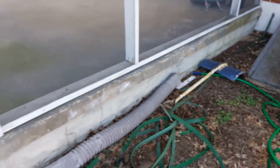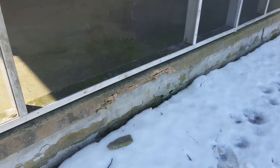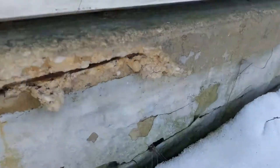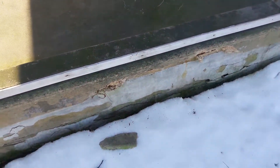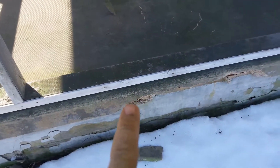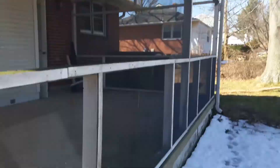The porch is in good shape otherwise — it just takes a little repairing. You're going to cut that out, get rid of the rusted metal, and put some rust neutralizer on any remaining ends after you cut it out. Then you're going to close this up and seal that area so water does not get back into your repair, because when you close it back up you'll have a thin line again where moisture would want to come back in.